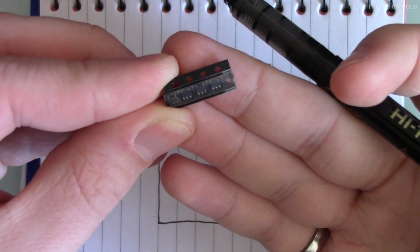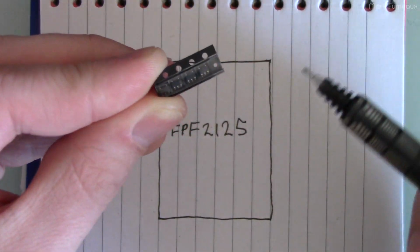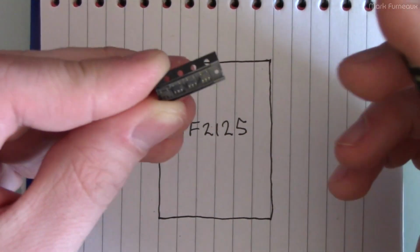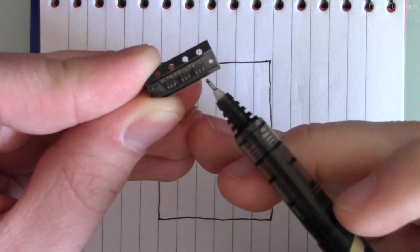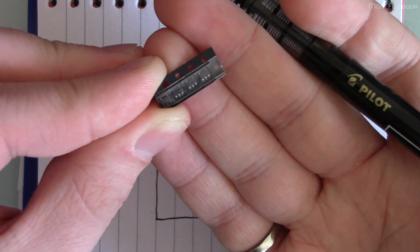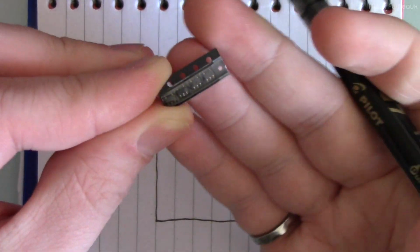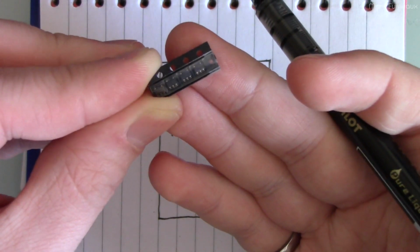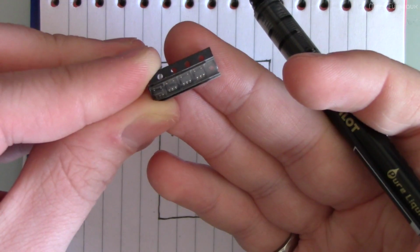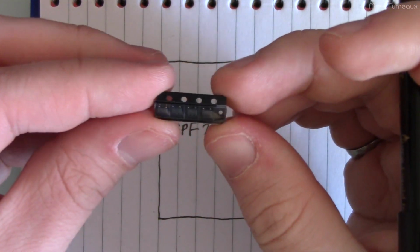And of course this looks very small, and that can be very daunting to someone who hasn't soldered before, but I used pad per hole through hole board, and you can use these with that because the pin in the middle on this side is the only one that doesn't line up. So all you got to do is just bend that pin up, and then just solder a wire to it to a nearby pad, and the other 4 corners can just solder onto the pads. So it is possible to solder these onto those pad per hole boards if you want.